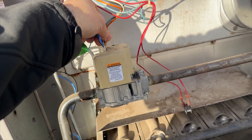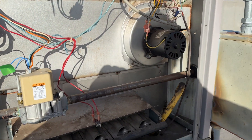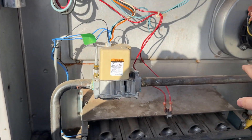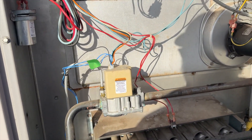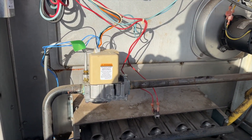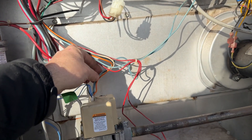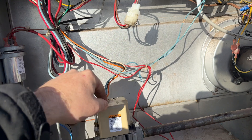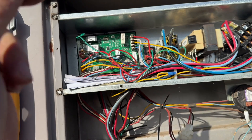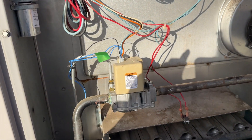So all our control boards and everything are working. We might have a bad connector or something — it's hard to say. The last tech here had banged on the regulator and it came on. Since the regulator is on the same line, that's probably what happened. I don't think it's the regulator because we got gas, but I'm still going to come back and put that vent protector on. We need to find another one of these valves. Black and white is 24 volts all the time; blue goes through the pressure switch, and orange sends 24 volts to the control board, which tells it ignition is complete and turns on the fan.